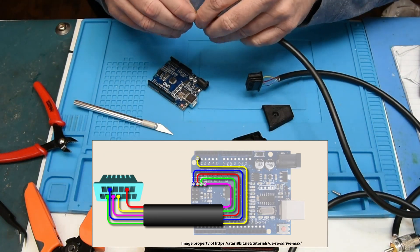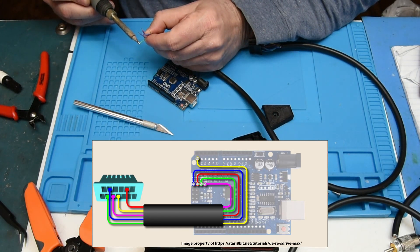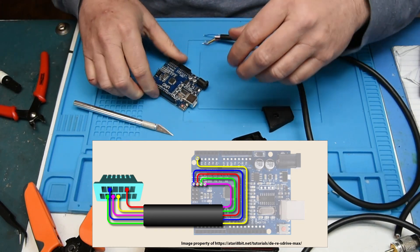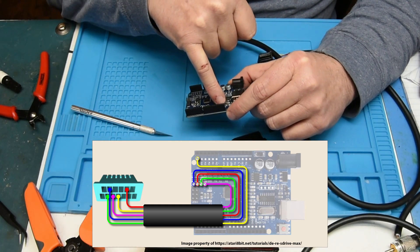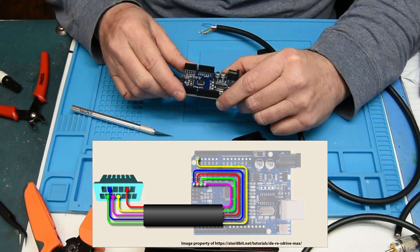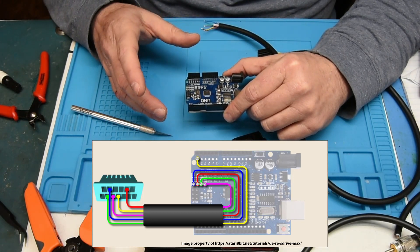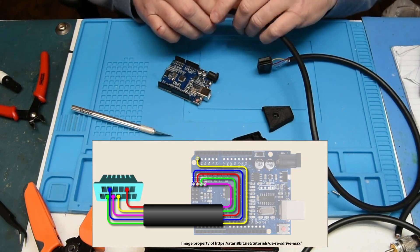We can actually do that right now. Following the directions, all you need to do is hook them into the right locations. They have a number of Arduino boards that they suggest. This one has pin headers but also solder positions next to them, which is really nice. It also has solder positions for transmit, receive, five-volt, and ground. We're actually going to power the Arduino and the screen from the Atari. There is an option if you don't want to do that — you don't hook up the five-volt line — however, I'm going to hook up the five-volt line.